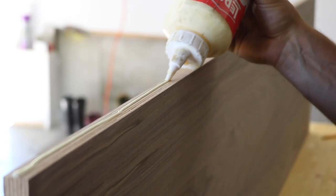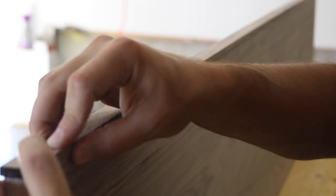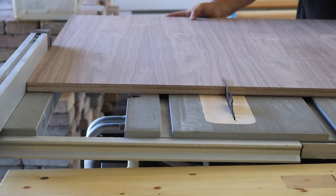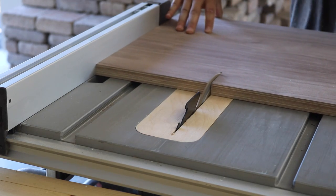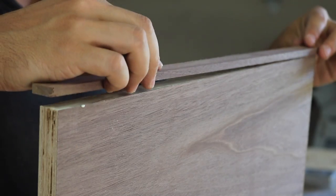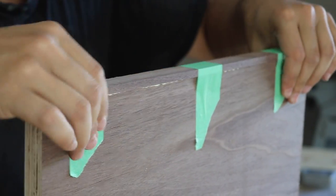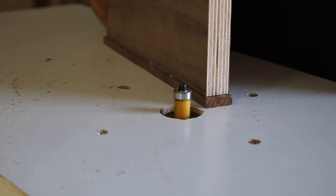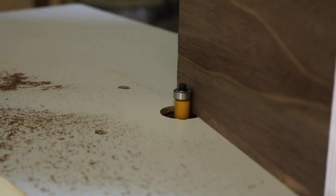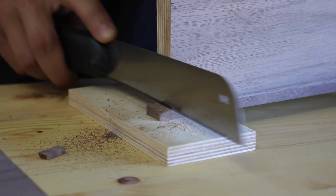I got most of the plywood pieces cut at my local lumber yard so it would be easier to transport. I started right away with gluing the solid walnut to the edges of the plywood and used painter's tape to hold it in place until the glue dried. I used the same process to cut the ends and the dividers, glued on the edge banding, and once everything was dry, used the flush trim bit on the router to trim off the excess. Then used the flush trim hand saw to cut off the ends, and gave everything a quick sanding along the edges.